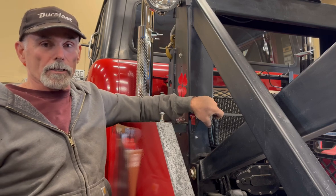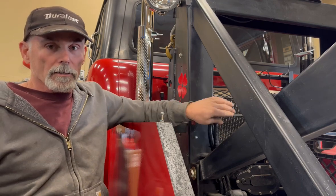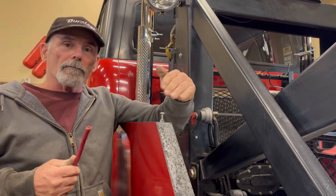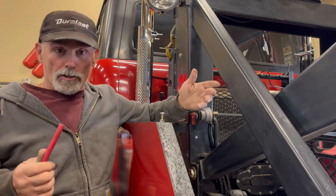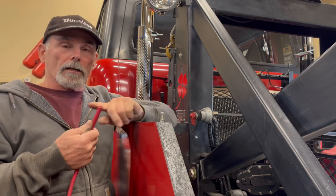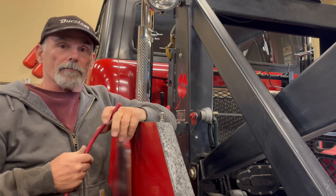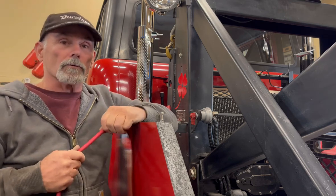One of the big cables here goes to the boom, the other one goes to the chassis, and the other one goes to the positive of the battery. Now, make sure you use big enough cable so that you don't have a voltage drop when something draws it, like a starter motor, something that really does draw a lot of current. I generally go with number 2 on battery cables, unless I'm running clear to the back of the vehicle and have, you know, 8-10 feet of cable. Then I'll go down to number 1 and make it really big.